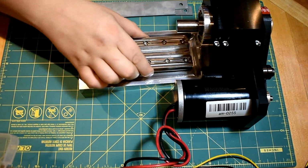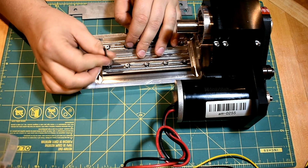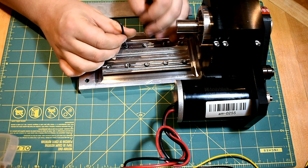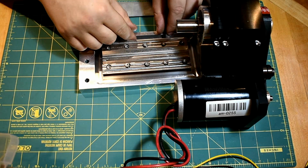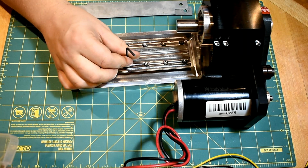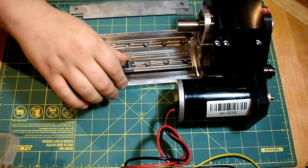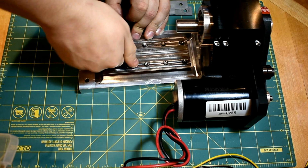So that actually screws on right here. I am going to get this bottom part anodized too. You'll see in the machining footage I actually managed to break a tap off in it. So I used a junky end mill to get that broken tap out, but I think there's still a bit left in. And nothing makes anodizing companies angrier than having steel get in their tanks. So I'm going to have to get that out, I think.